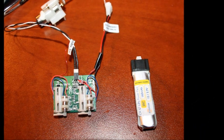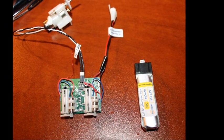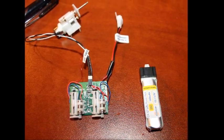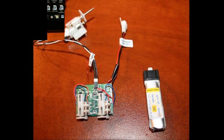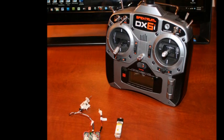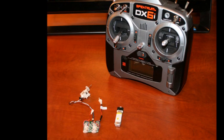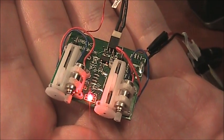This is the electronics for the ultra micro radio control system. The green electronic speed control brick on the lower left has the two linear servos; the receiver and electronic speed control are all built in. The motor plugs in directly, the antenna is at upper left — the short copper wire — as well as the battery connection at upper right. You'll need a transmitter that is compatible with the ultra micro system. Horizon Hobby makes both the Spektrum and the ultra micro ParkZone systems. I've had great luck with the Spektrum series of transmitters. This is the transmitter working — very positive, quick response for the linear servos.